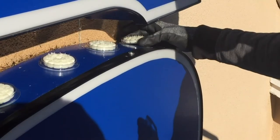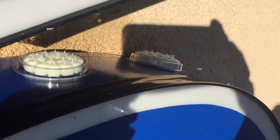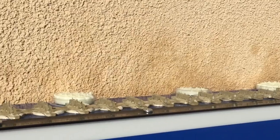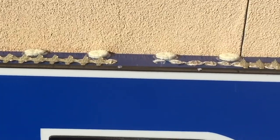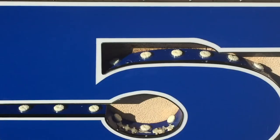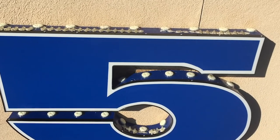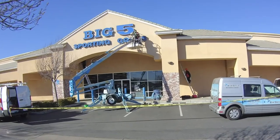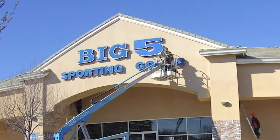Once the surfaces were dry, dishes of Bird Free were fitted with silicone at 15 centimetre centres. The landing or staging area on top of the sign was treated with dishes of Bird Free at 20 centimetre centres. Bird Free was fitted to all the surfaces of the sign on which birds had roosted and nested. Once complete, the dishes of Bird Free were invisible from below.